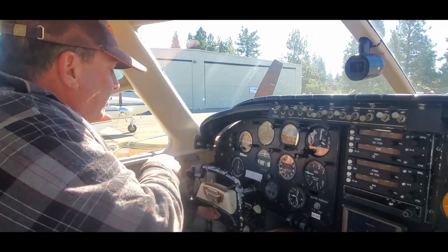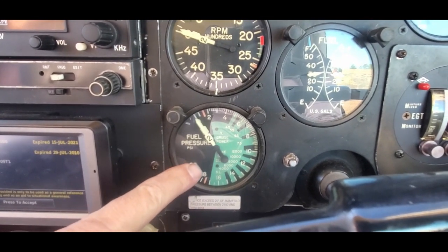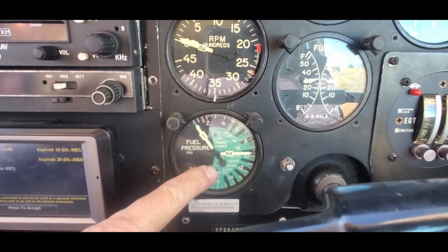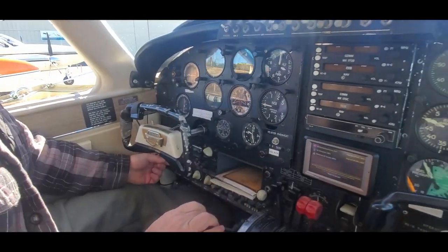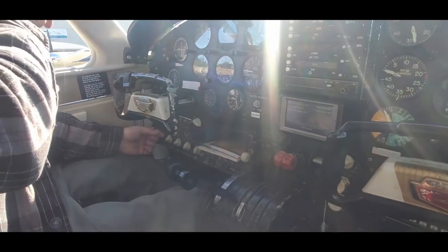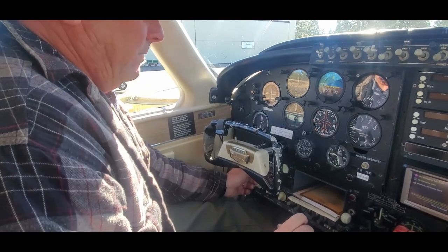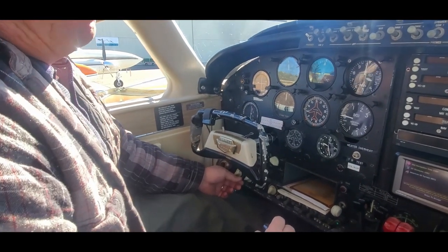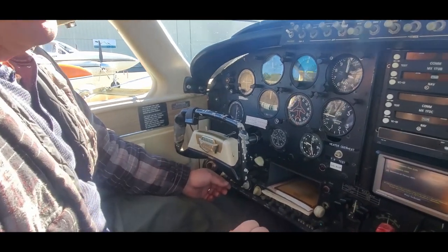So look over here, there's low. Now look over here, Jordan, and there's that low boost, and there's high boost, and about that much prime, shut it off. Here's the number two engine, low boost, check for operation, and then prime with high boost. Now over here, we're gonna bring the throttles back and I'll just crack them a bit. Clear. We're gonna increase the throttle until it starts. Then bring it back down to 1,000 RPM. And then set the mixture right about to there.